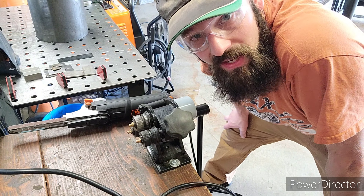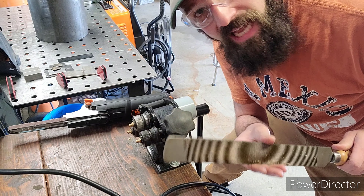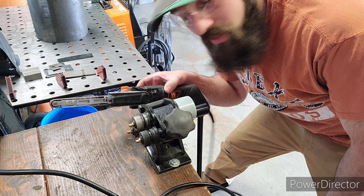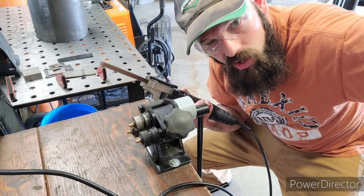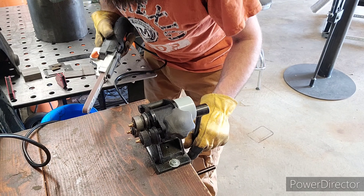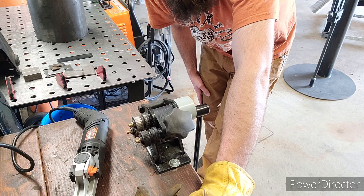Just a quick update: I was running a file over these wheels and it didn't seem to be doing much, so I switched to my larger rasp file. However, I noticed it began damaging my rasp file - so whatever kind of steel this is, it's fairly tough stuff. So I'm going to go from a file to a Dyna file. It's just sandpaper, so if I ruin this belt I can throw it away - don't want to ruin my files, those are expensive. That seems to have done a nice job - knocked those down quite a bit and they're a lot smoother.